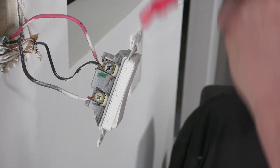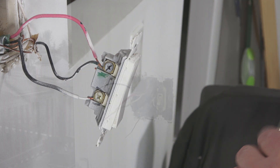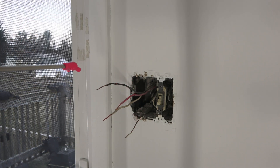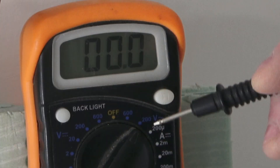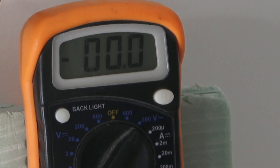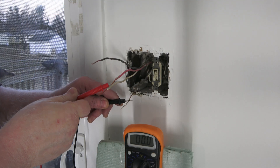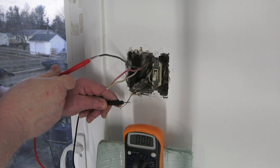What we'll do is remove all these wires and let them stand right in the position they're currently in. Here's the other switch — you can see I have the wires spread out nicely. What we need to do now is turn the breaker back on and then we'll find out which black wire is hot all the time, whether it be in this box or the other. With a multimeter, choose your AC side — I'm on 200 volts because we're working with 120. Ground: no power. Power. No power. Power.